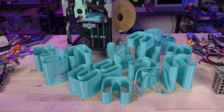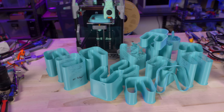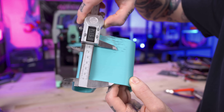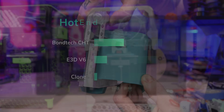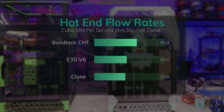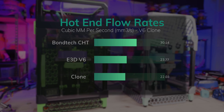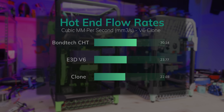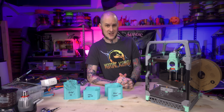Starting with the budget V0 and its basic hotend, I printed three tests with each of the three nozzles to get averages. I looked for the point where the hotend and extruder can no longer keep up and gaps appear in the wall, measured up from the base with calipers to the failure point, and noted it. Surprising absolutely nobody: with the basic V6 clone hotend, the genuine CHT nozzle is the clear, far-and-away winner at around 30 mm³/s — kind of mind-blowing on such a basic hotend. The E3D nozzle put in a respectable number, but coming up the rear is the CHT clone. That wall of brass is absolutely restricting flow on this hotend.